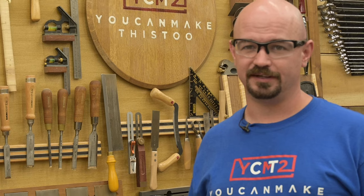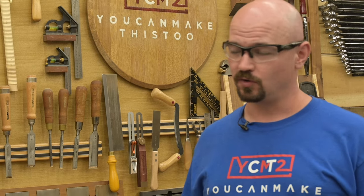After a couple of wash cycles, we're already starting to see some effects. Pretty much the finishes that have wax added are holding a lot better, whereas the mineral oil — as you can probably tell if you've used it before — is already really starting to dull and not show much. So here are a few options. I hope this was helpful, and that you're inspired, learned something, or at least entertained. Until next time, make time to make something.